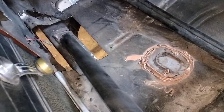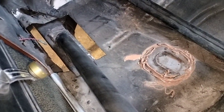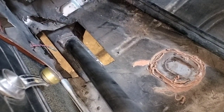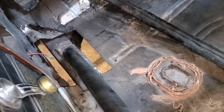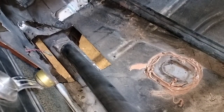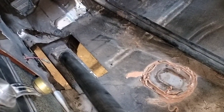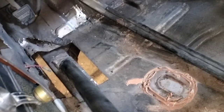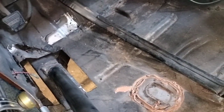Our tubes are all welded up. The hardest and probably, I would say, worst looking welds, they're not booger welds, but they fall into the category of caterpillars, is the down tubes. They're really, really hard. If I do this ever again, I'm going to build pedestals or put a slight bend into the bottom, because it was really hard to get the gun in the bottom corner. But everything is welded in. Besides those two welds, everything else I'm really happy with.